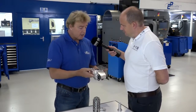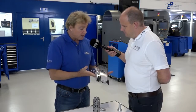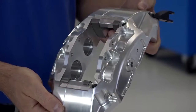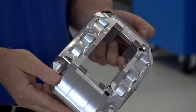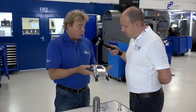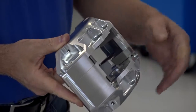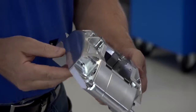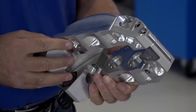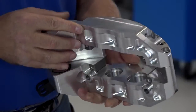This is a product that I designed about 4 years ago. Again, we make this on our 5-axis Hurco. It's obviously separated into 2 parts. You can just about see the join there. But we used to get this manufactured by another company, and it was probably about 6 or 7 operations. On our Hurco, it's 3 operations each side, rather than 7 operations per side. Again, that keeps the accuracy pinpoint.